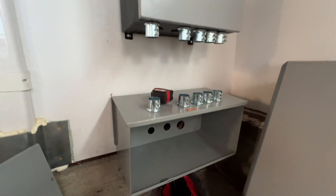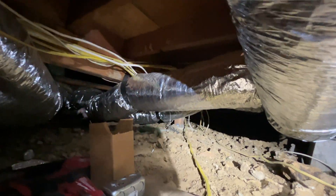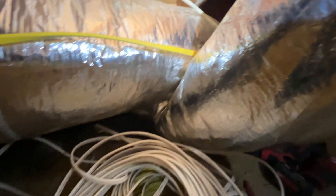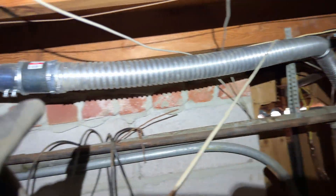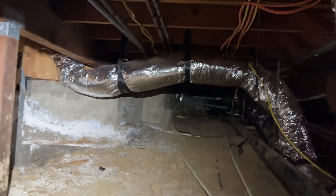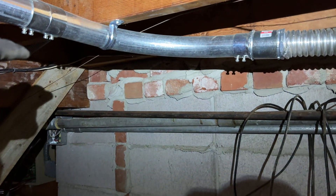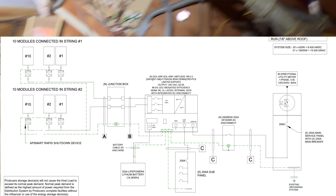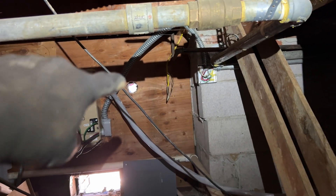Here's the installed gutter box, and now it's the fun part of installation. We need to run those cables into the sub-panel which is somewhere there. This two-inch metal conduit with a flexible metal conduit is going to the main panel right there, and to the other side of the house where the sub-panel is. So what we're going to do is disconnect this flexible conduit and run it to the AC disconnect, which is the hole right there. This service entrance cable is going to go to the main panel and connect to the lug kit, so we'll provide power to AC disconnect, then from AC disconnect to Solark, and then to sub-panel.